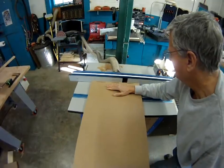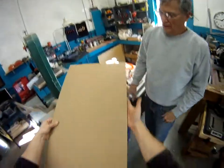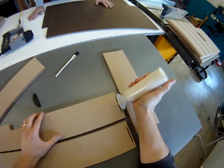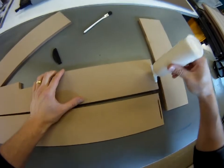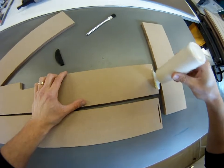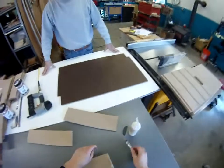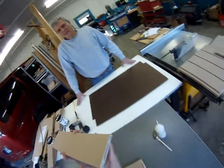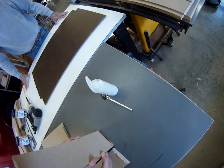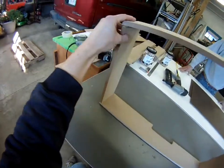Next we headed back over to the router, put on a radius bit, and put a nice beveled edge on the top of our box — nice clean edge, no sharp edges — and started gluing up the joints. Remember you've got to put good high quality glue and fill in those slots for the biscuits so they'll swell up and create a nice tight joint. A small brush will work just as well as the high speed biscuit glue appliers. If you do it right, your biscuits should swell up and make that joint nice and tight and actually be stronger than the wood surrounding it.